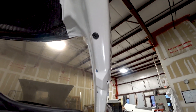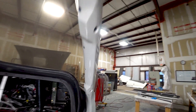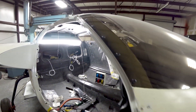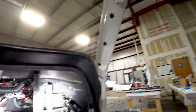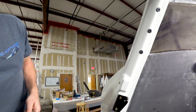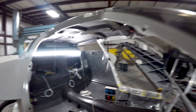Starting out the week with a less exciting job — installing hardware bolts and nuts into the A and B pillars. These were needed because we weren't sure the windows would hold after post-curing. Got them all in by lunchtime, and they're all sealed with RTV silicone to help stop any leaks with pressurization.